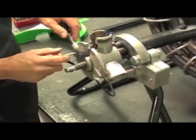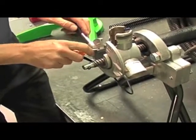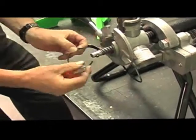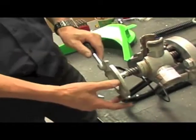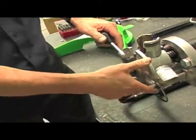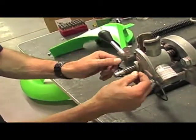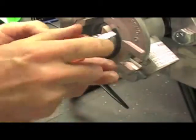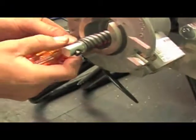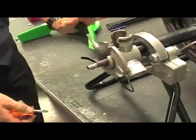They work a lot smoother with the grease behind here. So in that case, you'll just remove the circlip with a flat screwdriver, take it off, and obviously the cam plate comes off. You can see this one's actually pre-greased and it's got some grease behind it. So when you're reassembling, you're going to put some grease on it and refit that cam plate. When you fit the cam plate ring back on, just go like 10 o'clock, 2 o'clock, go around that, and you can roll it around with your finger, get the screwdriver, and it will click into place. Just make sure it's inserted in its little groove all the way, and when the grease is in there, that's fine.